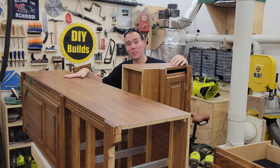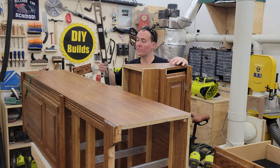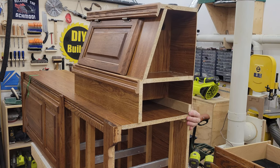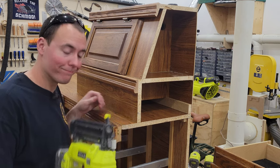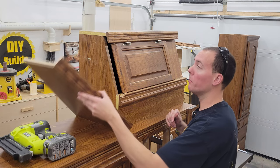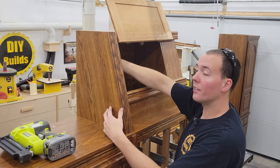I've struggled to get this up here all by myself — I highly recommend having someone help you, because god damn, that was heavy. But we're now going to take this piece and marry it to the side down here. I'm just going to use my straight edge and level to make sure everything's aligned, and then drill everything in from the inside of the drawer area with some two-inch screws. I'll make sure everything won't move with a few nails, and then we'll get to drilling. Seems very well attached. The last thing to do is attach the tabletop — it goes right like this, pressed up against the front, dead ending here. I'm going to attach it with a few inch-and-a-quarter pocket screws from the underside so you won't see any holes.